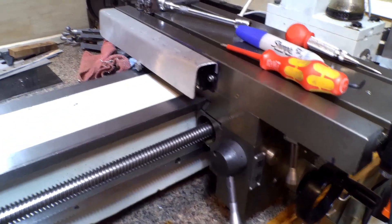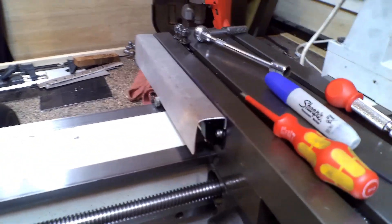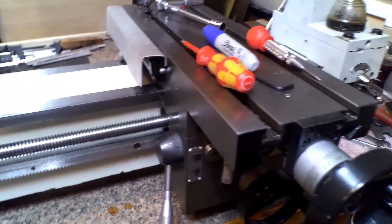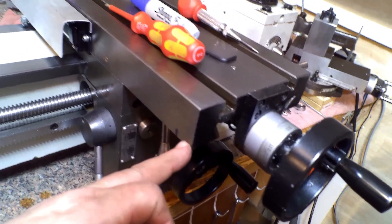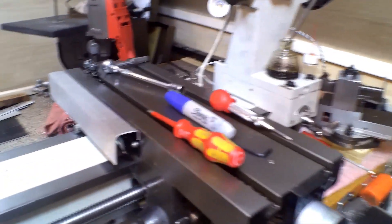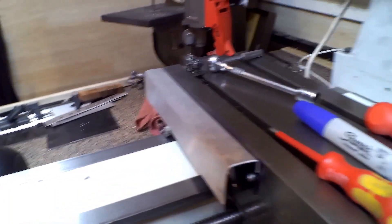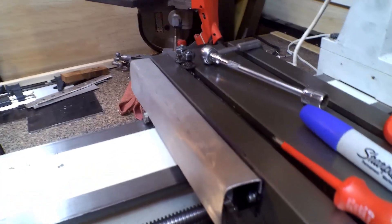On this machine, that's what you have to do when there's not enough room. I had to lose a little table travel to fit this scale - the next size up would have been too big. I've been waiting to buy one since I had this machine. I basically marked my table with marks of where I use it so I could see if I needed more travel. I put stops on the table so I don't crash the scale - there's a positive stop there.